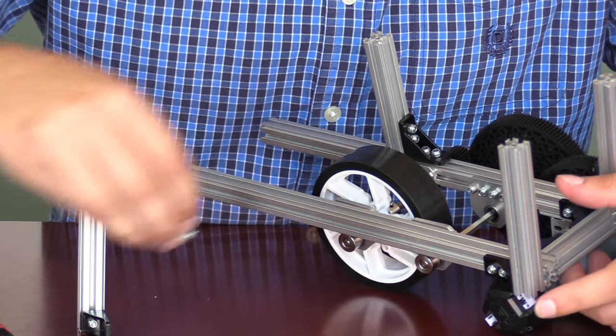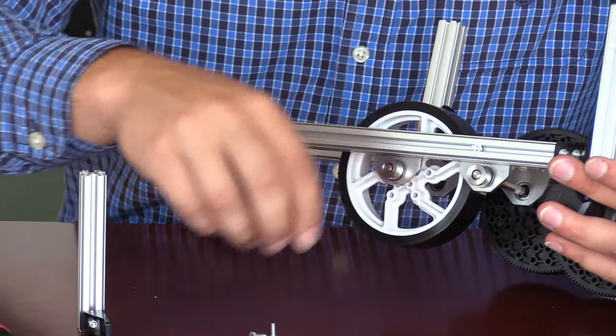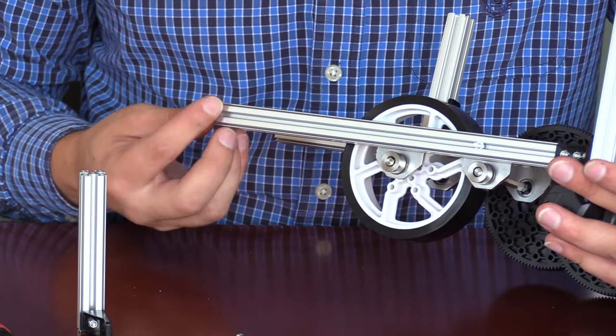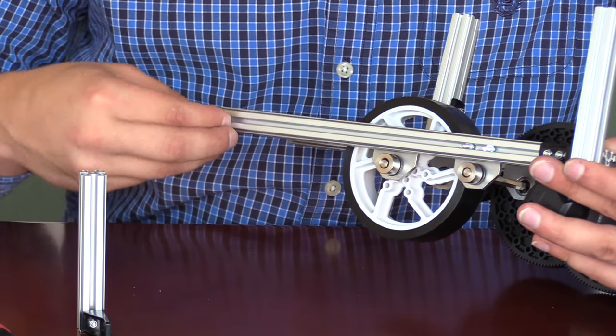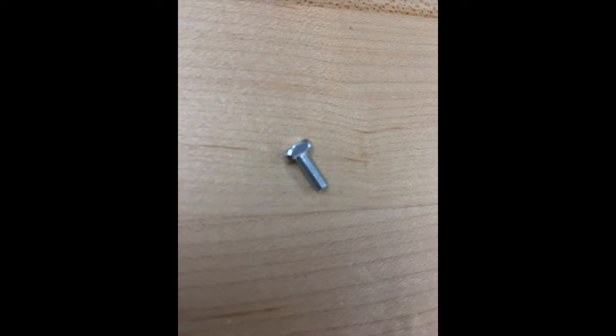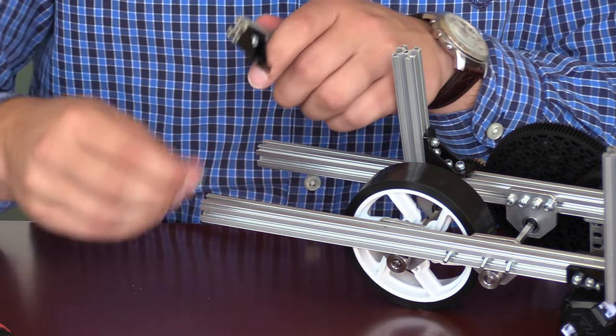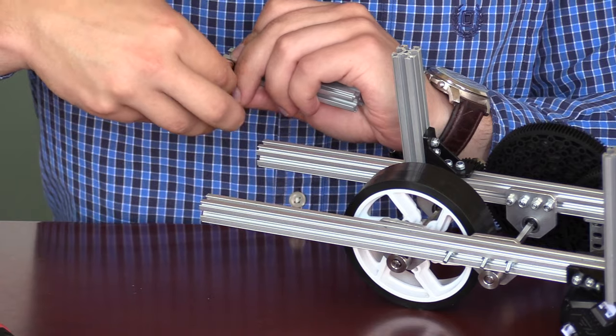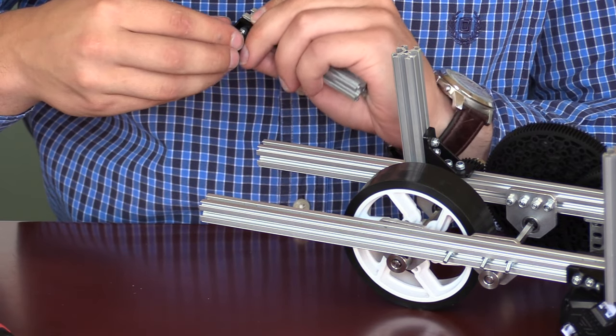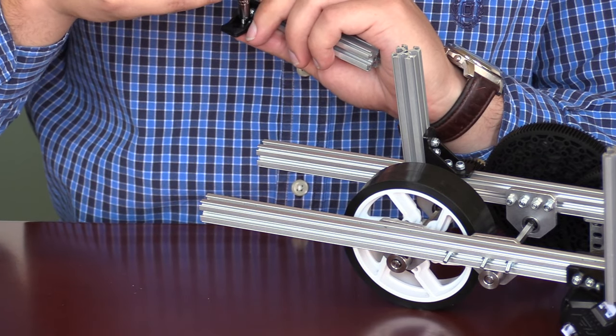In order to attach a future piece, we will now need to slide three of the bolts onto the base between the piece of lap bracket and the next one that will go on. If you forget this, in your kit of parts there are things called T-slotted screws. These can be slid into the channel even once there is no way to slide them onto the ends. You will notice later in this assembly that I forgot a few screw heads to put in early on — I'll indicate ahead of time where you can slide in bolts to save yourself a lot of time.